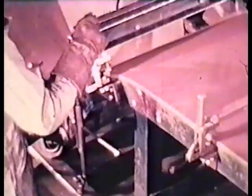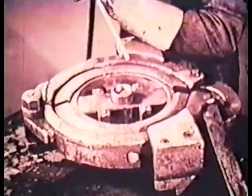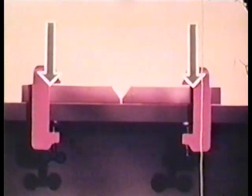The most important method of overcoming distortion problems is the use of clamps, jigs, or fixtures to hold the work in a rigid position during welding. In this way, we balance the shrinkage forces of weld metal with sufficient counter forces to prevent distortion. For example, when we weld two plates, we know that when the weld metal cools, the plates will distort. However, if we hold the plates perfectly rigid with clamps or jigs, the restraining forces prevent the plates from moving. Consequently, the weld must stretch as it cools. After removing the clamps, we see that almost all distortion has been eliminated. In most cases, other sections of the structure will continue to hold the plates as rigid as if they were clamped permanently, thereby reducing distortion to a minimum.